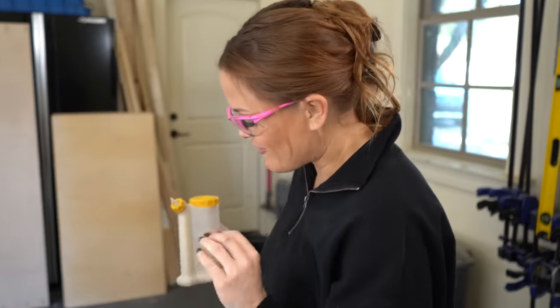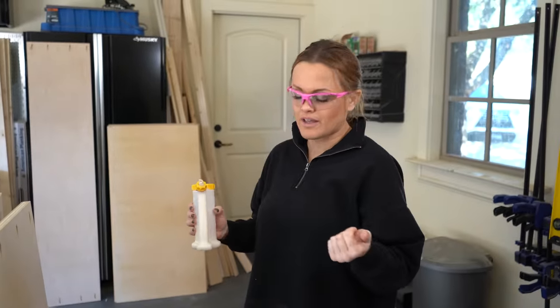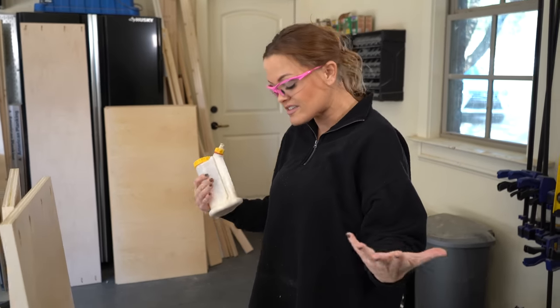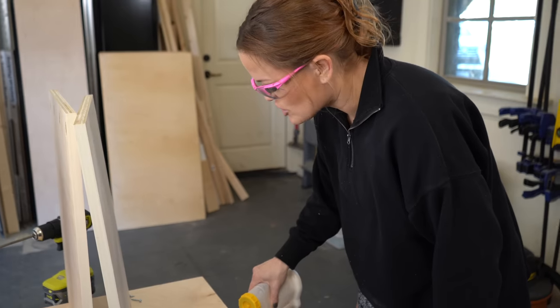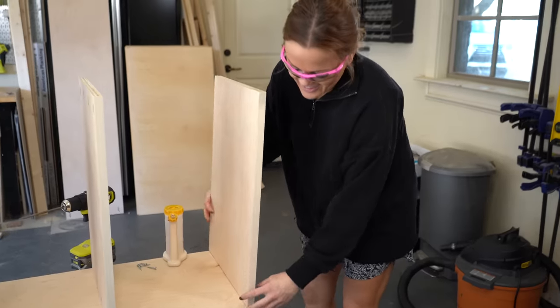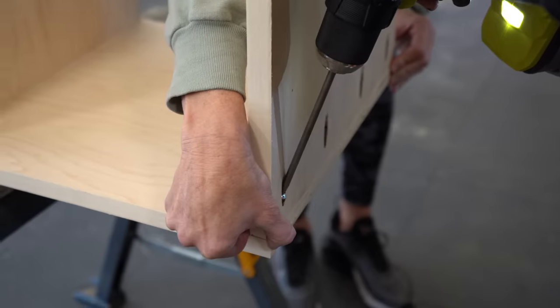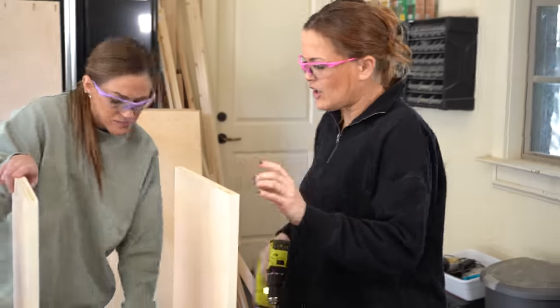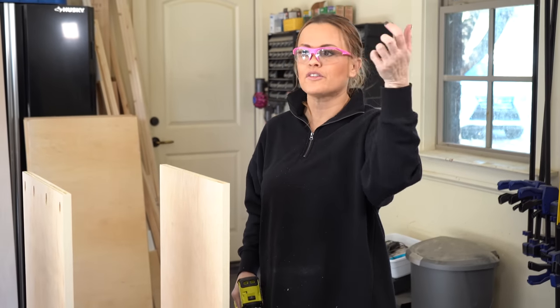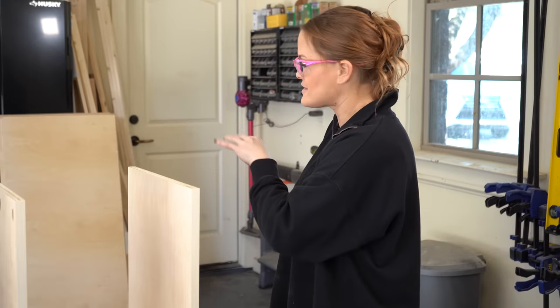So the final shelf is gonna be our top one, and I'm gonna face the pocket holes up on this because I'm assuming I don't have any 7-foot friends that will be looking at the top of it. And again, I want my edge banding facing forward. Okay, so now we'll take this setup off and put our other side on and get the drawer slide attached before we flip this over and attach that side.